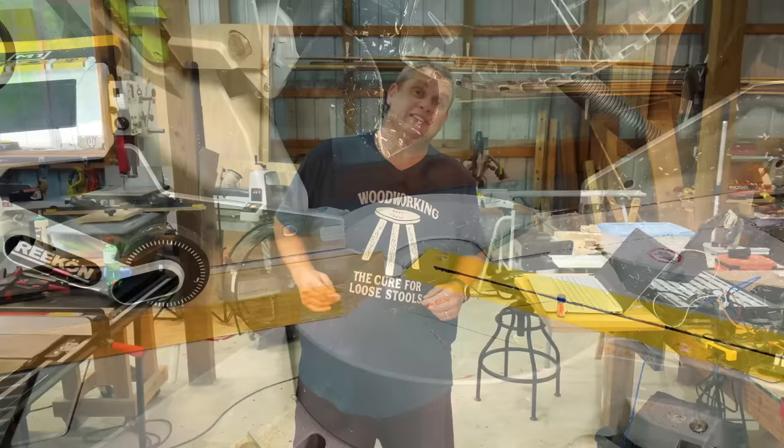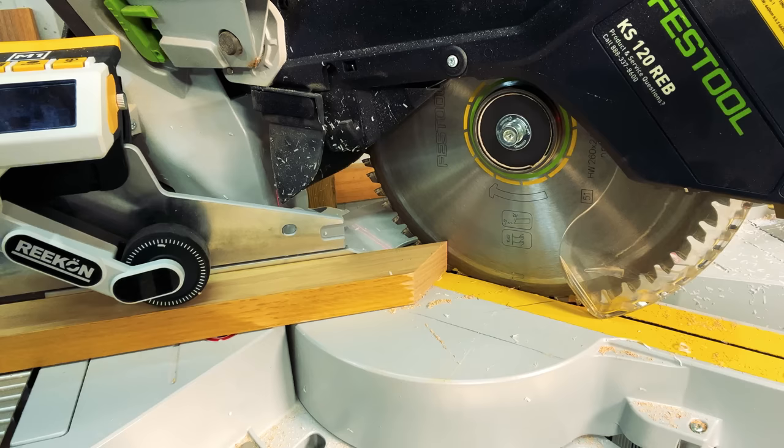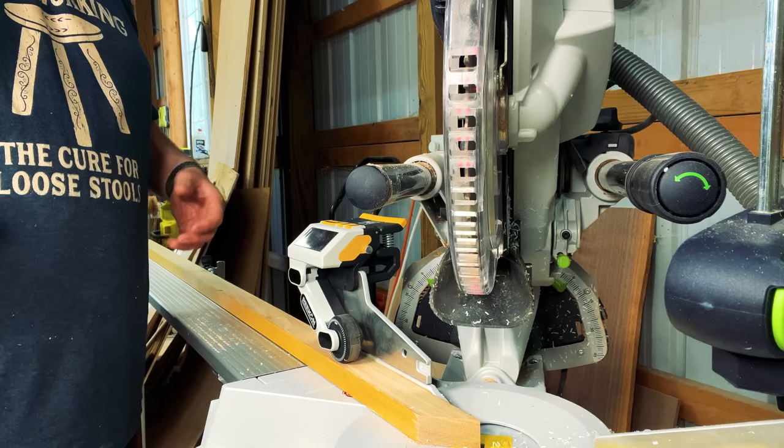You can see how the wheel cradles the round material just like square material. Straighten up one edge, zero it out, then make consecutive three-inch cuts. Here are the three pieces of pipe I just cut — I can't tell any difference between them and the measurement is dead on at three inches exactly. Now let's see if we can do some miters. Once you've cut your first miter, you lower the blade, push your wood up until it hits the blade, press the zero button, and cut the miter. I'm going to do a four-inch miter.